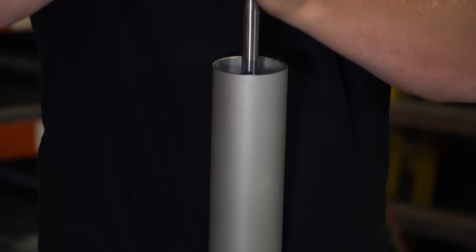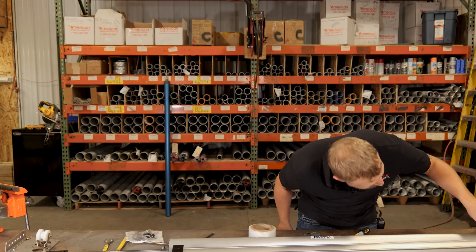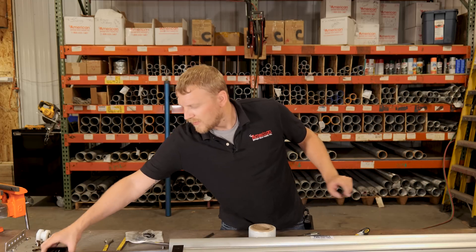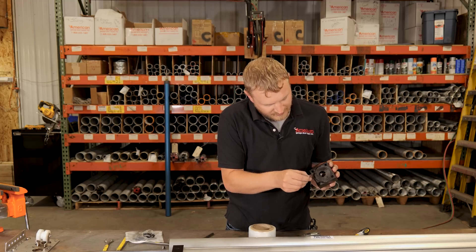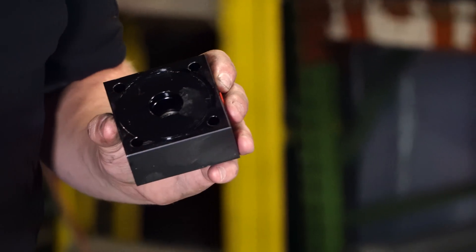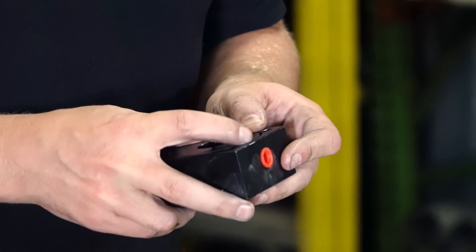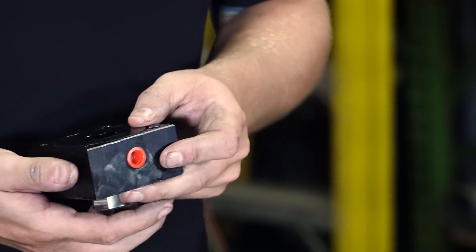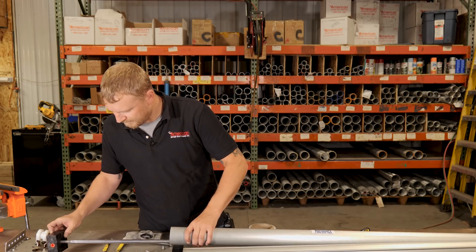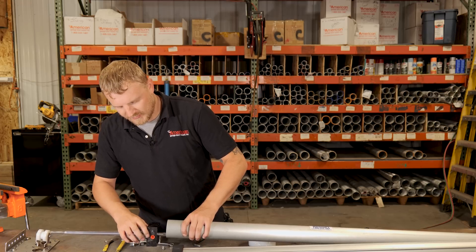The hard part is done. There are actually two little seals in the top and bottom cap — we're going to want to replace both of those. If you look a little closer here, you can see this one is actually ripped. We're going to take that one off, throw it out, and put a new one from this kit in. At this time we can start sliding this top cap back on — make sure your air hole is lined up in the right spot.